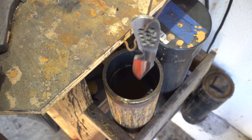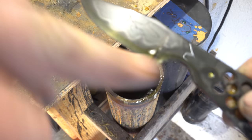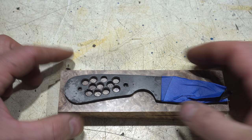I'm ready for the acid. I've got this hand sanded down to 2000 grit and my maker's mark is on it. Here it is after the second dip — looks kind of cool. It's got a little thing here, but I think the handle is going to end up covering that. So I've got the etching done on this, and now we're ready to do the handle.